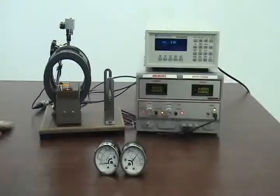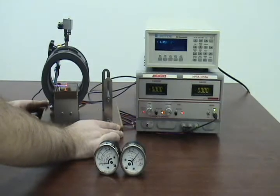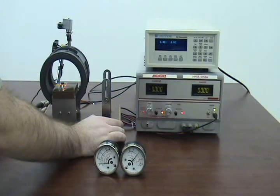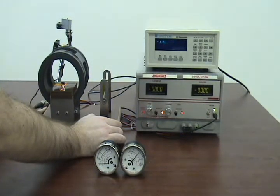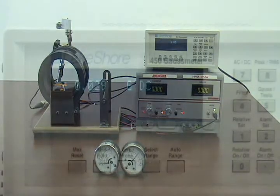The first step after assembly is to align the Helmholtz coil opening relative to the Earth's magnetic field. This will remove the error the Earth's field creates in the calibration process. It is very important that the selected setup location is physically away from metal tabletops and legs, as these act as flux concentrators for the Earth's magnetic field. In this video, we are demonstrating the process by placing the Helmholtz system on a wooden tabletop.